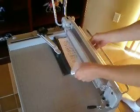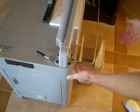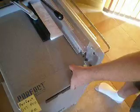I'll demonstrate a cut. Just raise this up here — you're going to have to raise both of them up. When this cutter is on the stand, the top is about 26 and a half inches high. When you cut, paper or trim lines can fall off the sides, so always keep a trash can on the side to catch it, or you can butt it up against a table. Once you get the paper squared in here and on the back paper support, pull down the paper clamp and give a couple of good pushes down. Then release the locking mechanism and pull down.